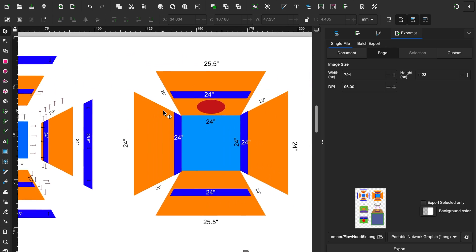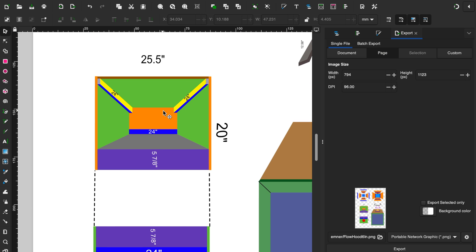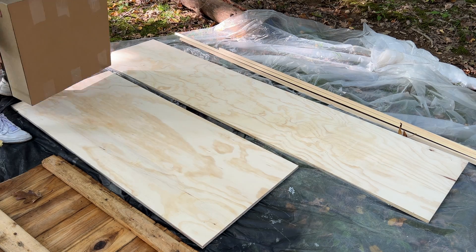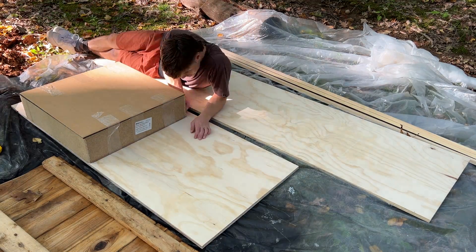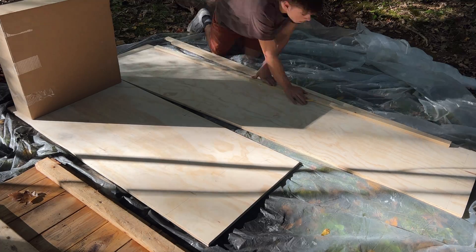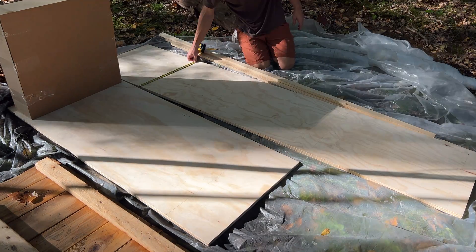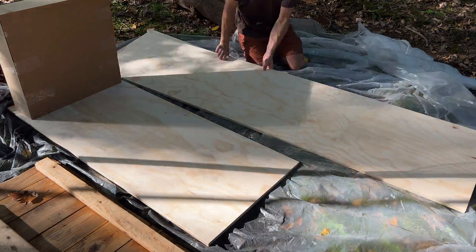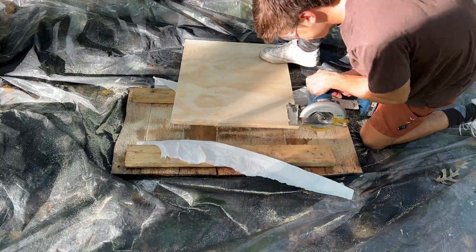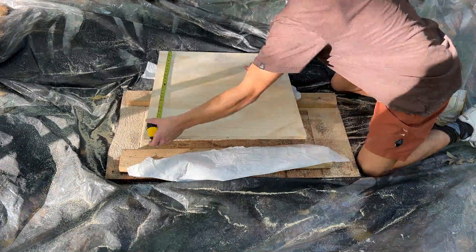I'm not going to go into too much detail about the nitty gritty construction because it will vary based on the design you choose, but I'll have the detailed plans I made for this project in the description, which you can use as a reference for your build. I'm starting out by cutting my plywood and furring strips to size. All these pieces are designed to snugly fit my 2x2 foot filter, so your measurements will vary based on the filter size you choose. If you're going to go through the effort of building a flow hood this way, I'd recommend making it at least 2ft x 2ft, as this is big enough to do most mycology work, including making fruiting blocks and larger mono tubs. 2x4ft is another common option and will provide an even bigger working area, but will require a more powerful fan and cost more. 2x2 ended up being perfect for my application, and also offered cost and space savings over the 2x4ft build.